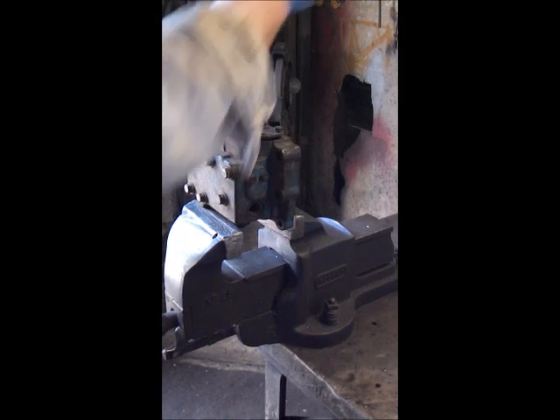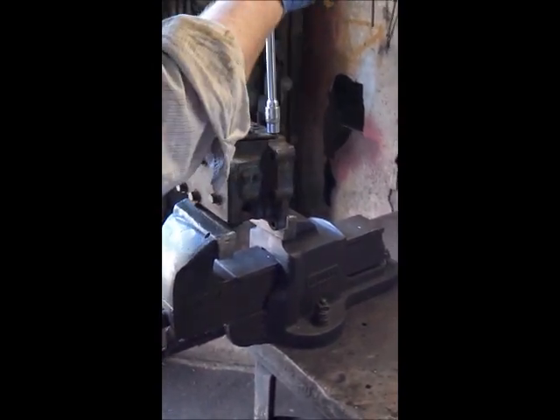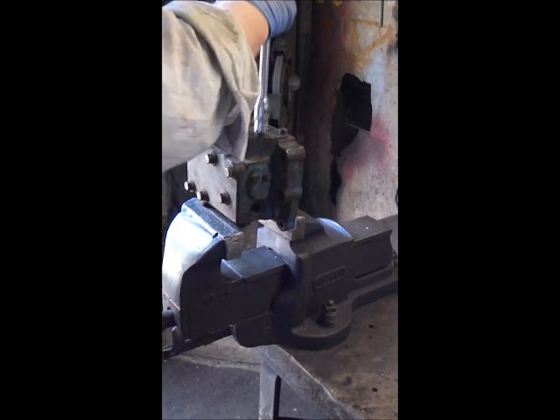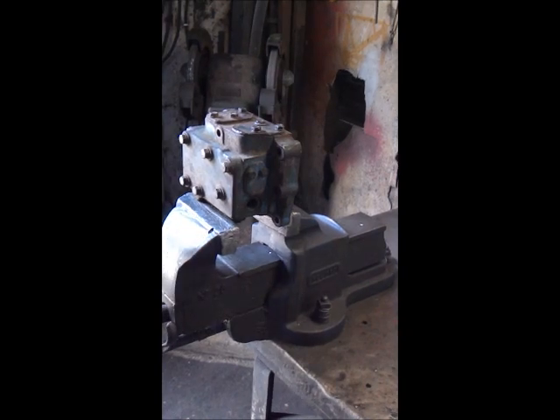It's the plate on the left-hand side of the valve chest as you view from the front. Don't take that plate off — it's only covering old oil galleries. Tighten the bolts up, and that is done.